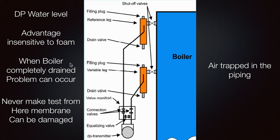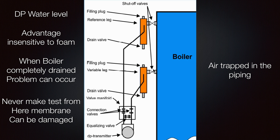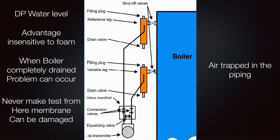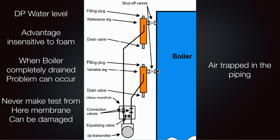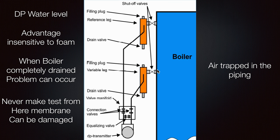Mostly this happens when you fully drain your boiler. We can actually prevent this when decommissioning — simply shut off these valves so all the water will remain there and no air will be trapped. After that, when we are filling our boiler, keep these shut-off valves closed. From the air vent, we will vent and see the steam, and then perform a proper air venting.